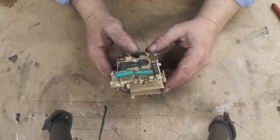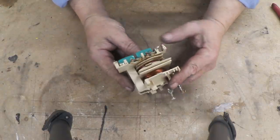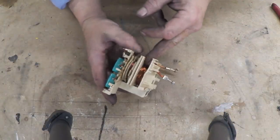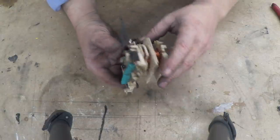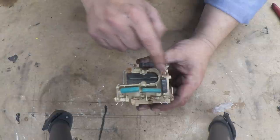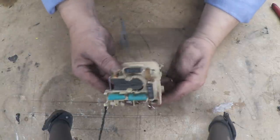It was stunningly easy to remove, and it's going to be super easy to modify because nothing is sealed. You can rewind the secondaries if you want. On this side it goes through rectification — a couple of high voltage diodes, a bit of smoothing, a couple of capacitors — so that is an awesome thing.